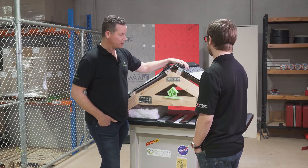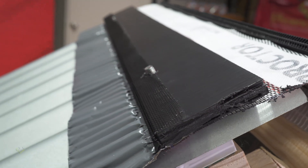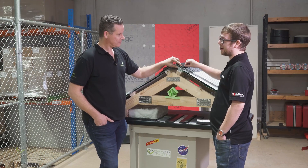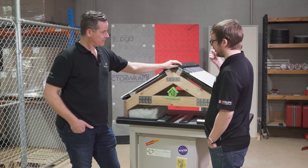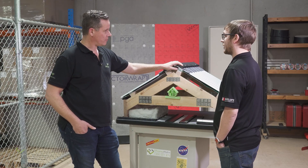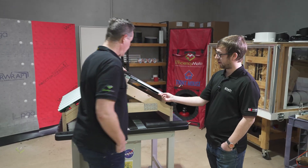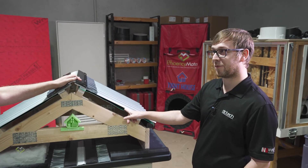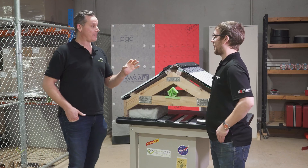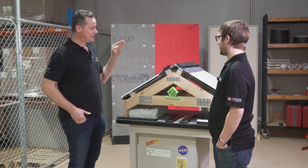At the ridge you don't have those issues because if you're using a BAL mesh that eliminates the risk entirely, and even the apertures in the ridge vent itself are too small for anything of significant size to get into the roof space. The BAL mesh is a solution at the top, but at the bottom it won't stop that gap between the roof metal and the sarking — which is what the eaves comb filler will do.